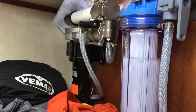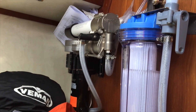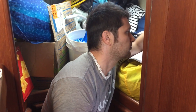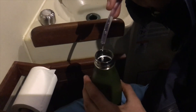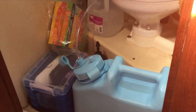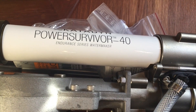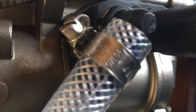At this point it was no longer leaking — it was basically working perfectly. We weren't interested in sticking around another week or longer to get a technician to look at it or a warranty replacement. So we decided to just take the gamble and continue on our trip with the water maker as is, and we had no more problems with it whatsoever. Looks like it really was just a slightly under-torqued head from the factory.